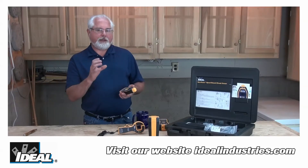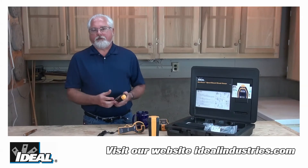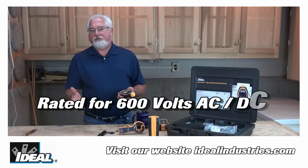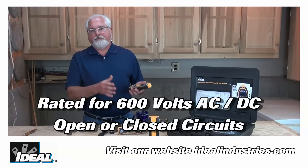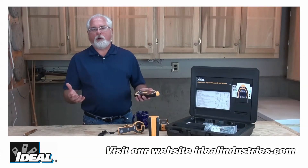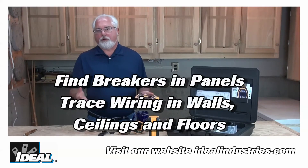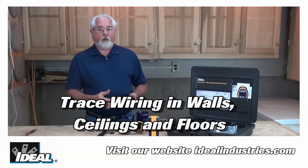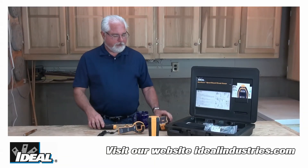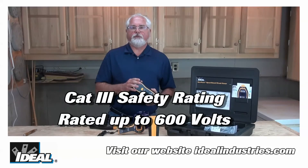All that information will simultaneously be displayed on the 959 model. These circuit tracers can be used on either energized or de-energized circuits from 0 to 600 volts, AC or DC, and can be used on electrical wiring or any low voltage wiring throughout a building — behind walls, floors, and ceilings. You're even good to go on a 480 volt phase-to-phase circuit because the transmitting unit has a CAT 3 rating good up to 600 volts.